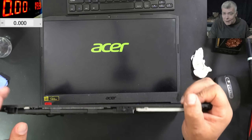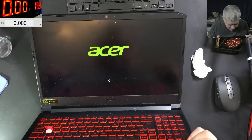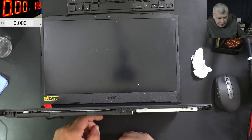We have picture - that's crazy! So actually that was the problem. I can't believe it. Just a little bit of liquid damage on the EC chip, and it's working fine.